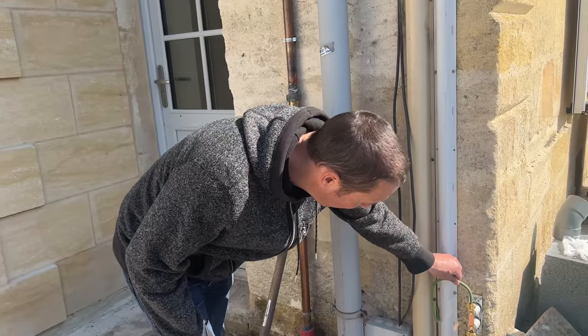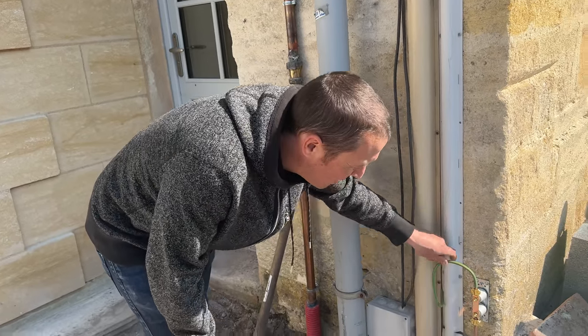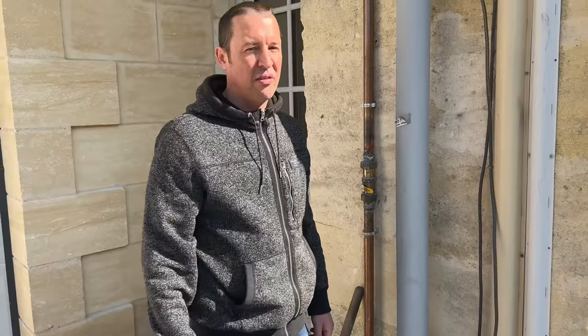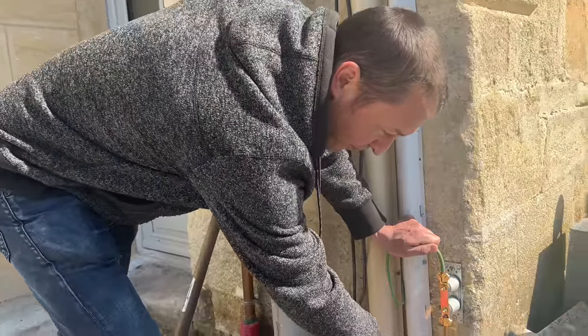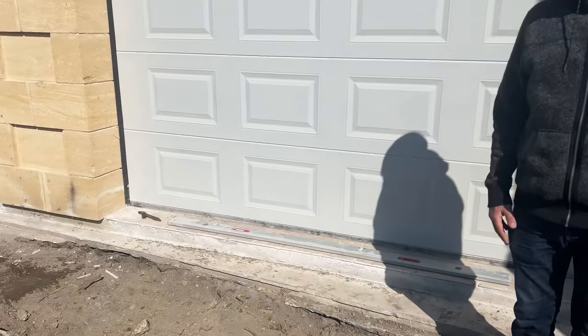I know it's a bit sad, I couldn't show you this because it was electricity-based. But I'm really proud of my little bit of work — it's a connection to earth. This little bar here means that if there's an electrical fire, the pompier can just come and cut the bar with an axe. And then basically we've got this new earth cable going in — we dug a huge area out here and then an earth rod as well. Fingers crossed that by nuking the earth like we have done, it should be enough. If it's not, we have to start adding more earth rods. But let's just hope it's good.